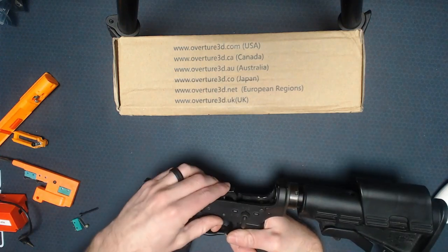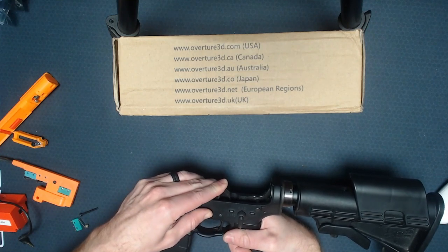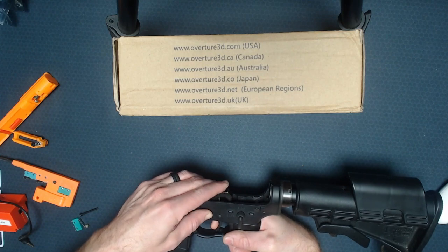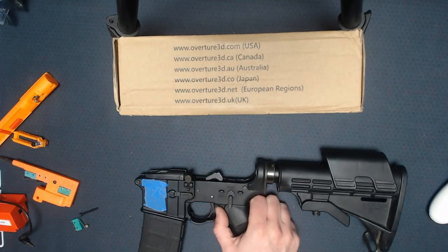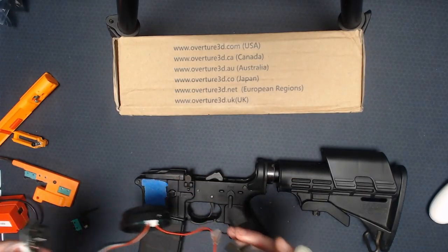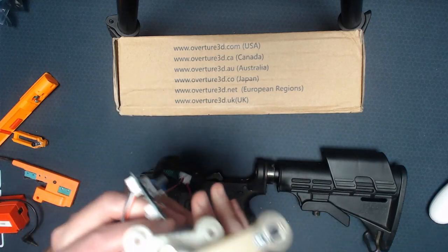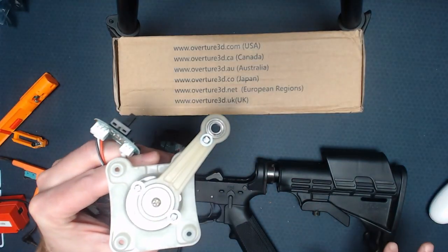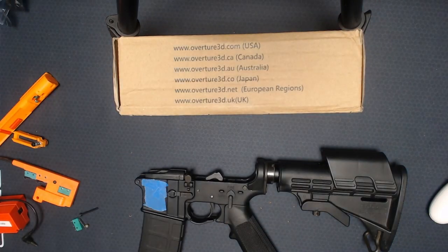With no pressure on the trigger, whenever you pull it and stop the trigger right after it breaks, you have something to bring it back down and then let go — that's your reset. Rotary motion would not be a good idea here. I've got a large motor with an arm, which would not work well for the trigger but would be good for simulated recoil on a stock. This came out of a massage gun, and that rotary-to-linear conversion will generate a decent force for a fake stock — more violent than something like Protube, which is really the goal since more violent means more realistic.